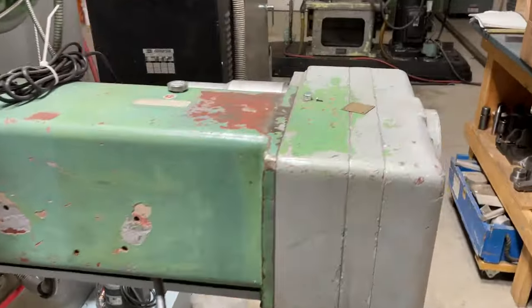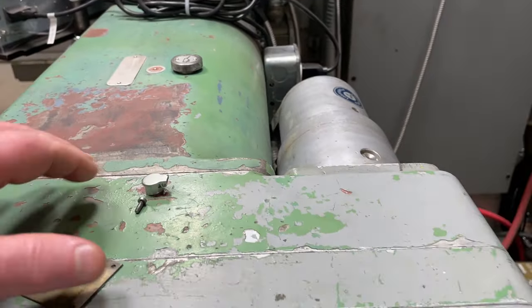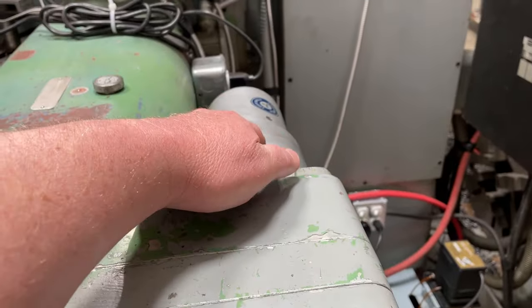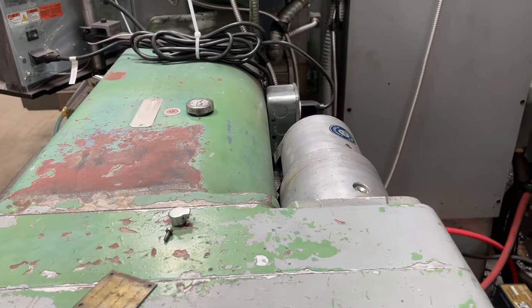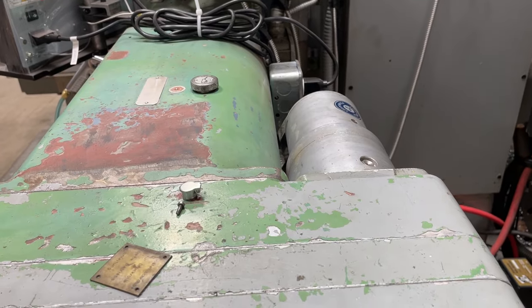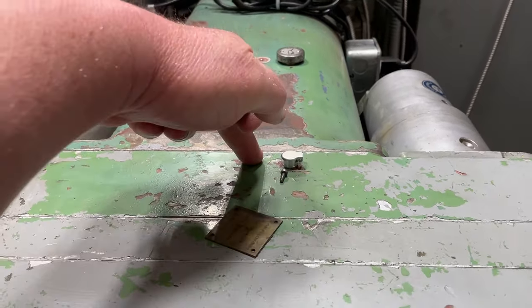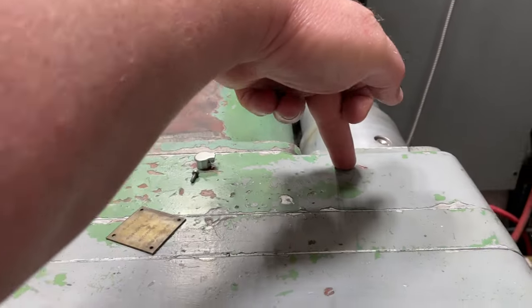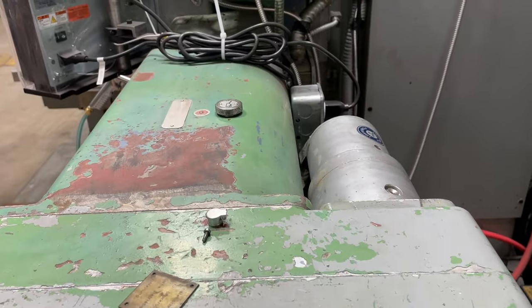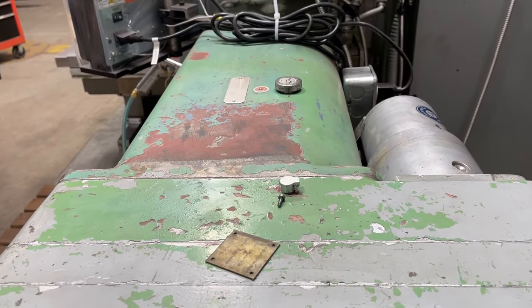By disengaging the drawbar through a clutch when the spindle's turning, the gear train and the motor aren't back driven by the spindle. So that reduces wear and tear and power loss and heating and things like that. As soon as you shut the spindle motor off, this clutch here re-engages, connects the drawbar to the drawbar motor, and the drawbar buttons become operational again.